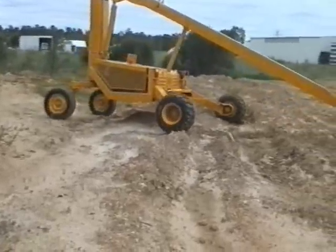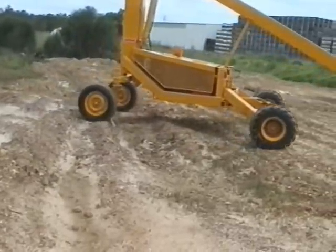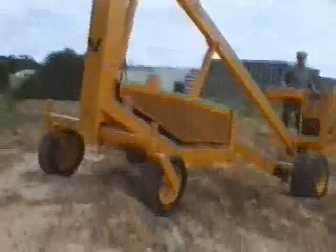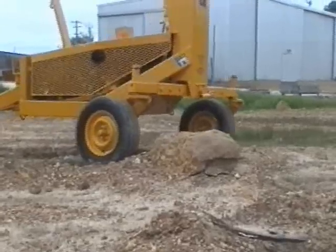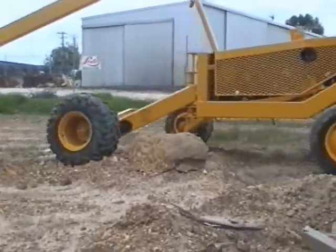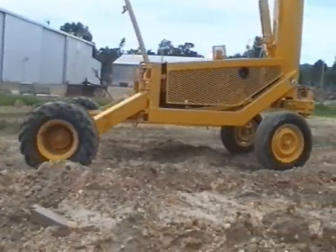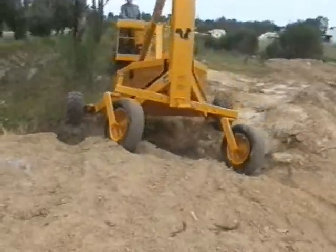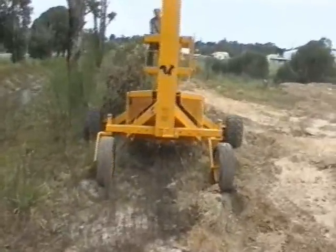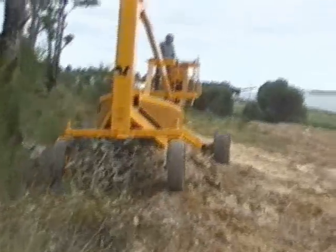This machine has superior stability with a smooth ride over rough terrain, due to its wide adjustable wheel track providing greater operator comfort. Two independent caster wheels give a smooth ride over rough terrain and enable the machine to negotiate obstacles. Drive wheels have a planetary reduction gearbox with an integrated hydraulic motor, incorporating fail-safe multi-disc wet brakes, which eliminate creep and overrun. Hubs have a quick-disengage freewheeling system. The independent caster wheels also greatly reduce the possibility of bogging.